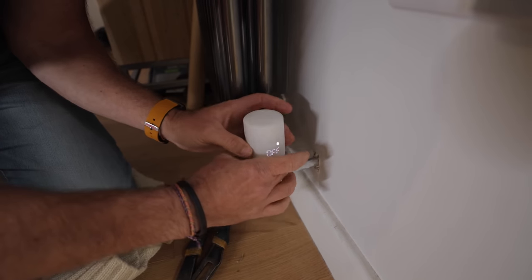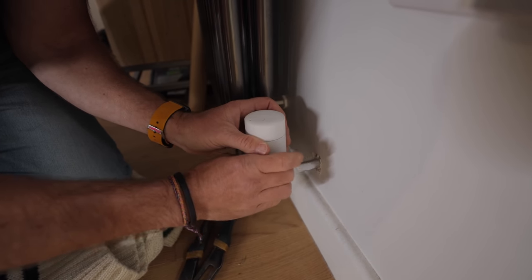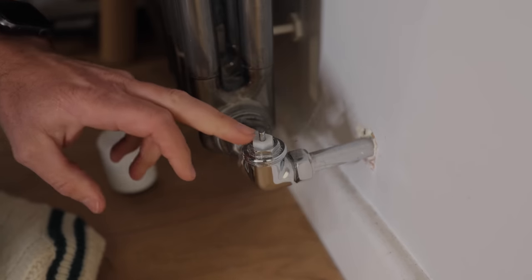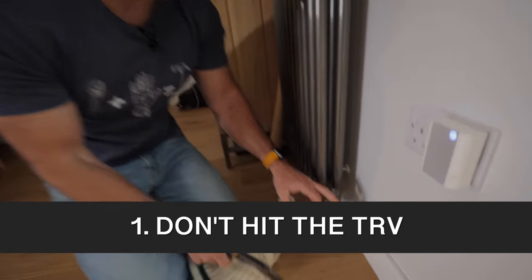This is something I see people do all the time in videos about the TRV pin. We've got a lovely Taddo valve here. Normally, if you've got a stuck TRV pin, people say get a hammer and whack it. Well, when I was an apprentice at Compass House in Cambridge, I hit a TRV pin like that and it flew out — there was about a bar and a half of water pressure with four stories of radiators above me. I could put my finger over it, but I sprayed the ceiling.